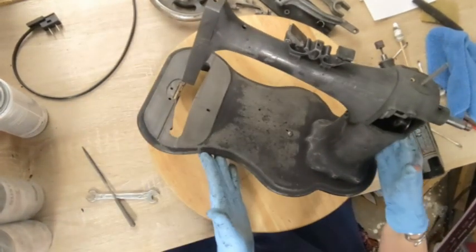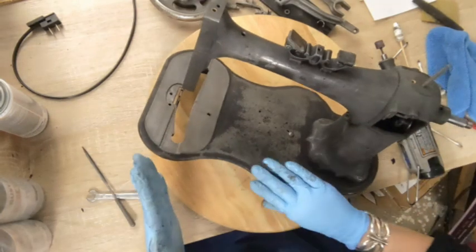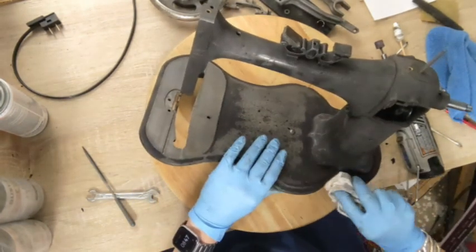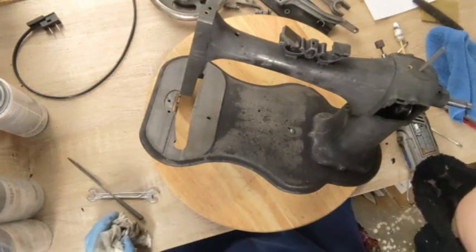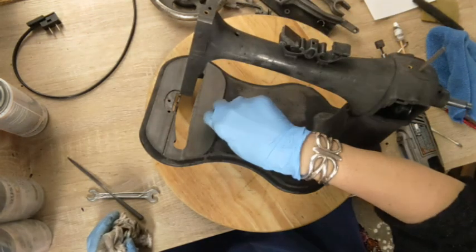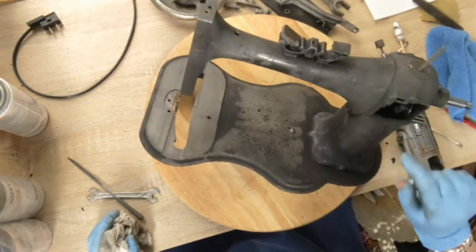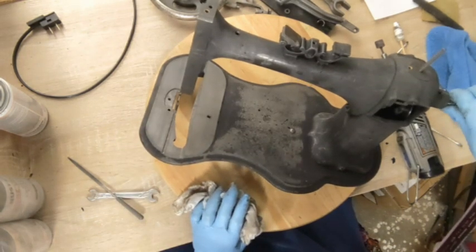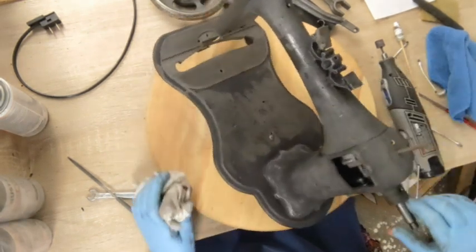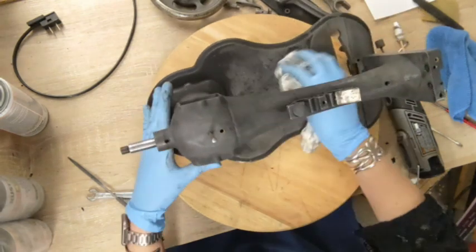What I wanted to show you is, well, first of all, when I pulled her out of the evapo-rust, I dried her off. I took an air gun and blew her out. And that's important to me because I want to make sure I blow out all of the little holes, because sometimes that liquid can just sit in there, and when you're painting, it can come out and just screw up your paint later. So, you know, got that rinsed off, dried off.